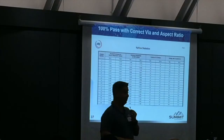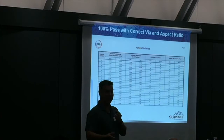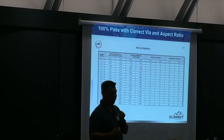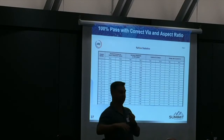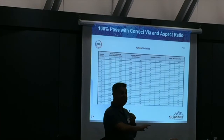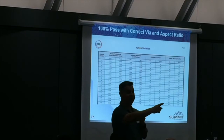Owen came up with the next generation of testing. Over the last seven years, they gave us a free test for two months and I took all my D coupons and started running through 24 reflow cycles to find out what's good and what isn't. We look at the structure, cross-section, stack, dielectrics, and finish. What I found was that if we make nice short squatty microvias with 6-mil or larger diameter, they seem to pass 24 cycles. One of our factories three years ago said they'd use the biggest microvias they could in the structures. Those things — 7s, 8-mil microvias — they'll go 24 reflow cycles at 260°C, I don't even pre-bake them. They'll run through a reflow cycle and it won't go over the threshold.